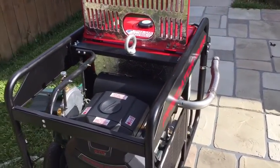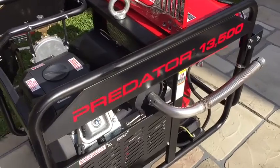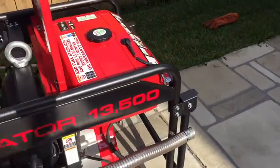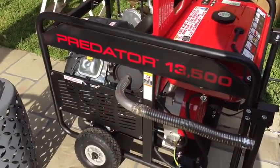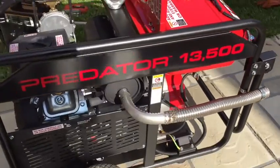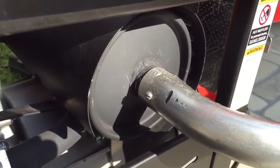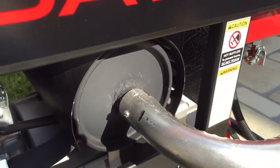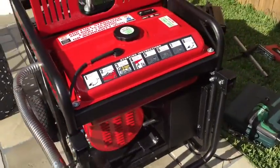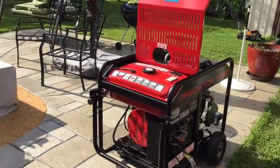Since I'm going to run this inside my quiet shed, I needed to route the exhaust in a certain direction — towards the fan that exhausts all the fumes outside the shed and keeps it cool. I welded a flex tube to a 90-degree elbow; it's a slip joint with a screw tacked in to hold it all together. That way, if I ever needed to take the generator somewhere, it's not permanent — it comes right off. The intent is to run this inside my quiet shed right over there.